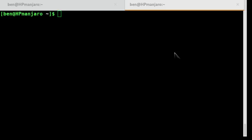Alright. So it's loading the connection. We're gonna log in as root. And we're in. Okay, so we're gonna do ifconfig. We have an IP. Let's see if we can ping Google. And we can. Yay. So let's cd to sources. We're gonna cd to Broadcom and try it again. Alright. We had a couple of errors. Let's see what they are. We're gonna cd to linux. Well, it booted, guys, so we're good.